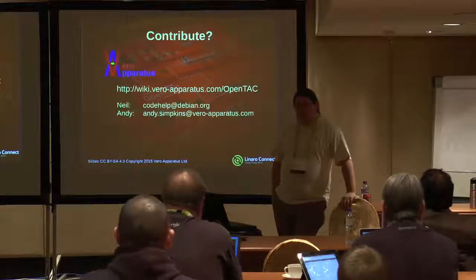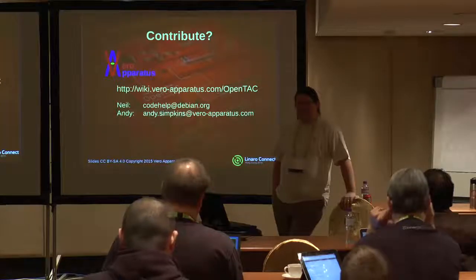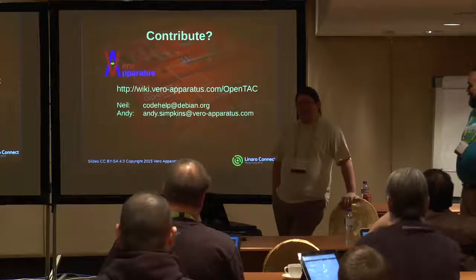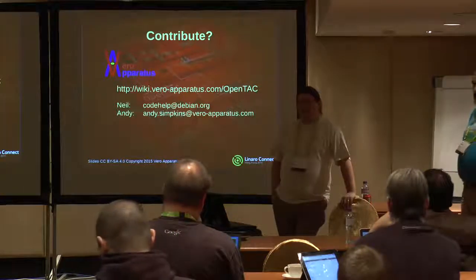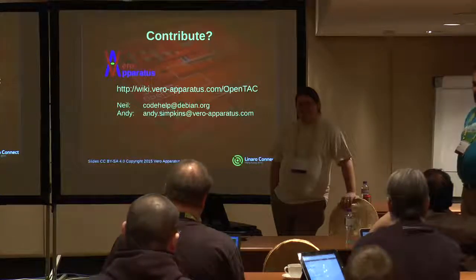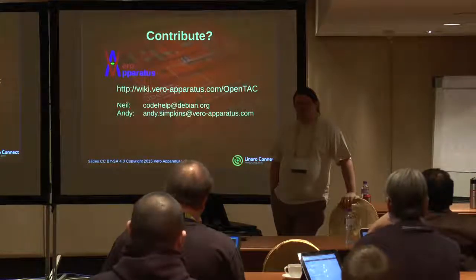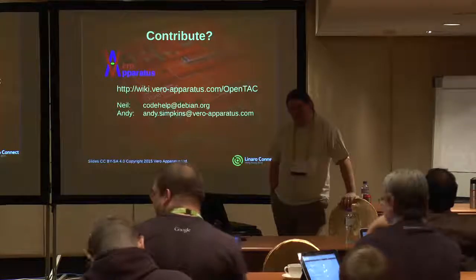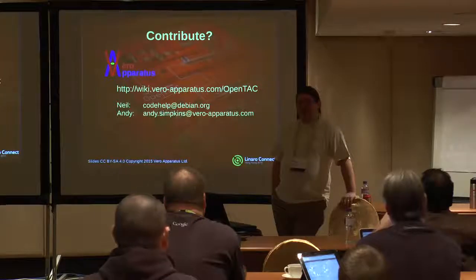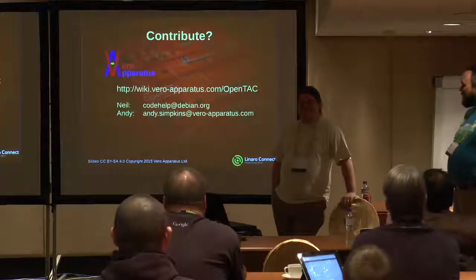Not so much the soldering, I have to confess. I've forgotten just how long it takes. To give you an idea, I'm currently 300 and something hours into this project. I'm getting a takt time of 44 connections an hour. That's not bad for hand soldering. But there are 2,600 connections per board. Yeah, now you can see why I'm saying I've bitten off more than I can chew. It really is going to take too long to do by hand. I thought I could do just prototypes. Now that was a mistake.